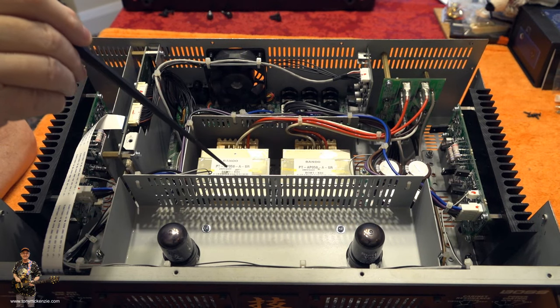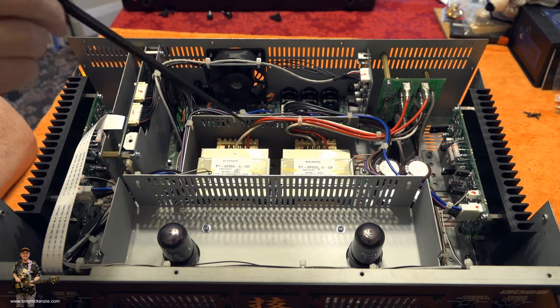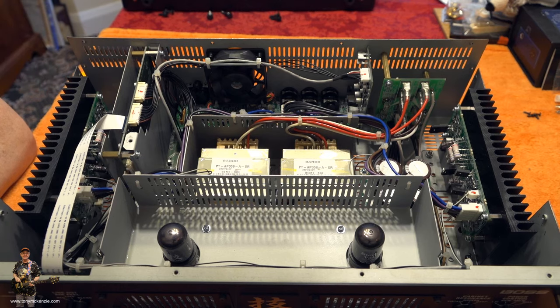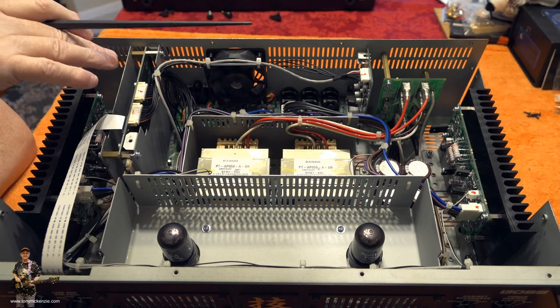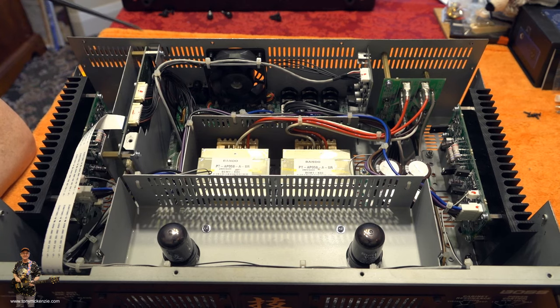There are two on this one, 230-240 volt power transformers, and they help to deliver out to the back, which we'll see later on, a 16 ohm cab. You could have a 4x12 16 ohm cab, and believe it or not, you could have a second 4x12 16 ohm cab, both plugged into this with this cranked. And I'm telling you, this will move you across the arena at 150 watts. It isn't the 150 watts that you or I would normally associate with transistorized power amps. This is far more than just a transistorized power amp, as those things at the front will attest. But we'll come back to those as well.